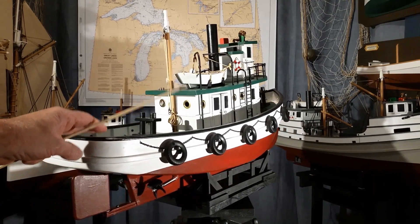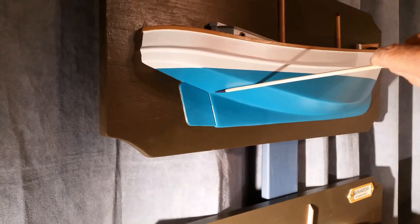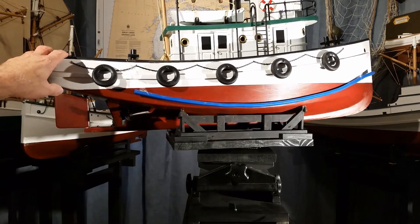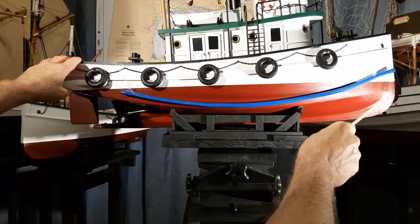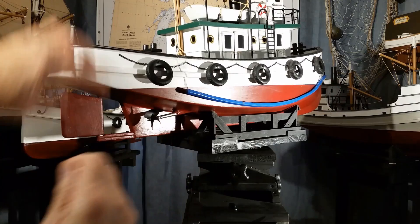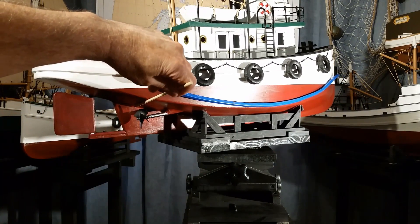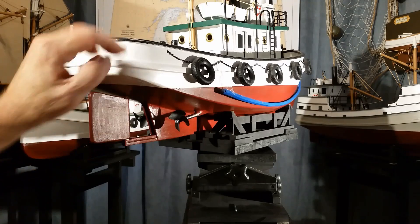It's a modified version of an earlier Haven design called Shenando. The Shenando hull was widened on the counter to provide more stability at high-speed turns. The blue line on the model represents the wave shape at hull speed. There's a buildup of water forward on a narrow bow. Aft, there is another wave buildup which supports the after end of the boat. The widened counter is very important because it allows the boat to stand up on its feet when doing turns at hull speed.